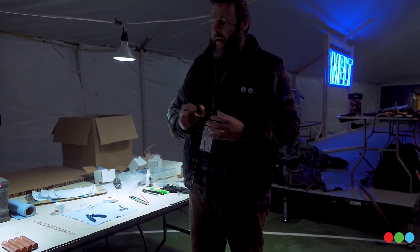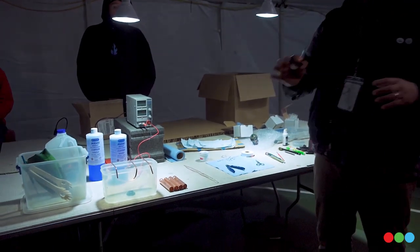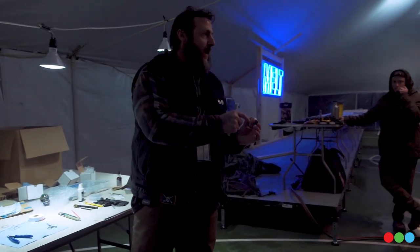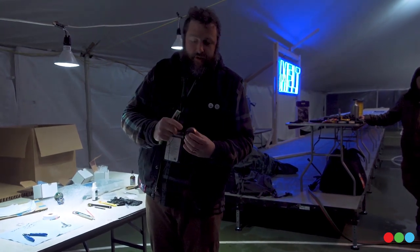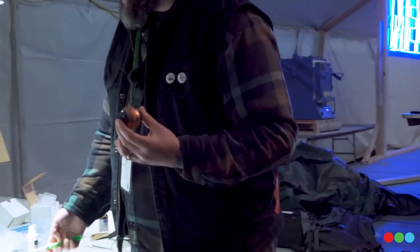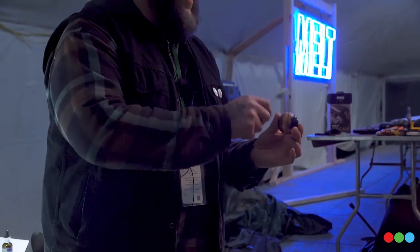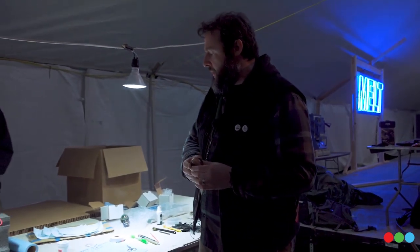So it would run for about a day, and then usually in the evening when I'm shutting down the gear, I'll pull this off and rinse it off. When I rinse it off, I'll hit it with a toothbrush, and all this excess paint washes away. Usually by day two, it's a little more stubborn in the sandblasted areas where I want it to remove. If that's the case, I'll dip my toothbrush in a little bit of isopropyl alcohol, and that'll take it right out. So I'm just real patient with it and go slow.